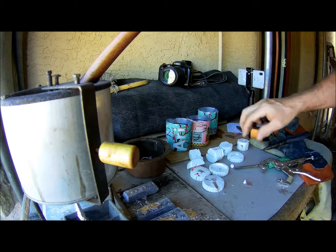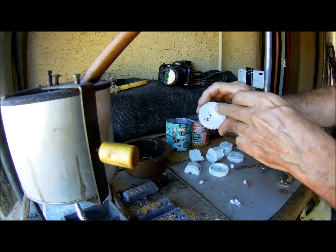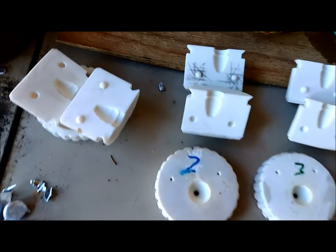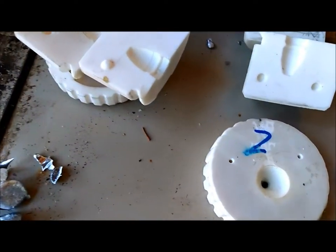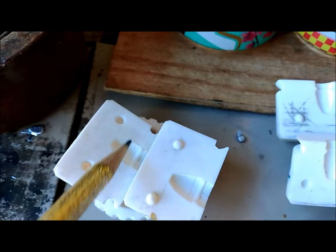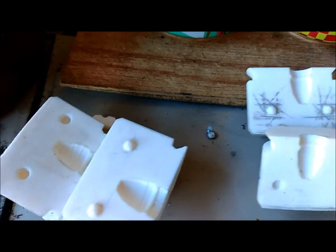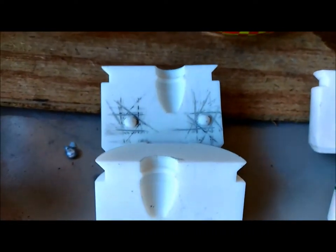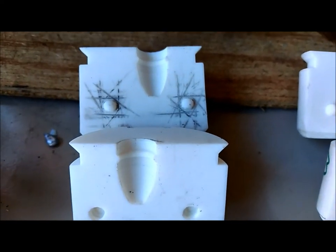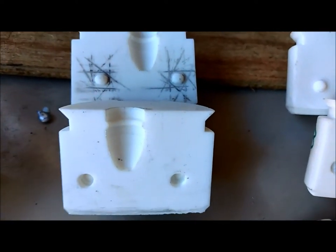I keep putting them in the wrong bucket. I'll be back once I clean this up and get ready for cast number four. I forget to take those off - if I leave them in there too long it creates a burn along the top edge. After the fourth go around I'm going on number five next. Mold number one has given up the ghost - it's no longer usable. But I wanted to point out that this half of the mold has striations going this way, yet the other half is pristine. I'm starting to notice the same effect on the other molds - one will show a little more burn than the other, although the surface is still excellent.